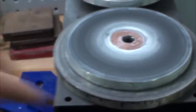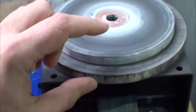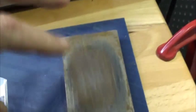All right. This is the interesting part, because there's a size difference between the stone and the diamond. You can either do all of that nonsense, and I had a chat with Steve Lindsay about it, and he sent me this, which basically is a hardened steel block at the right height. Essentially all I do is I find my diamond spray. I'm not going to spray it now, because as you sharpen on it 3 or 4 times, you actually drive the diamond grit into the face of the metal. So the more you use it, the better it becomes, essentially. So I try not to use it too much.